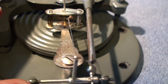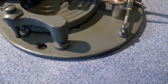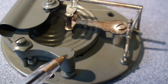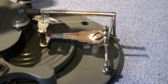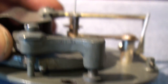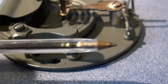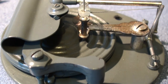Turn around. The screw you've adjusted in the back for setting the correct pressure is that screw there around the back. Basically that tilts the whole of the arbor system back and lifts that as well. There's a pivot point just down there — that's the screw on the back. So all of that mechanism tilts upwards, lifting that pin up and adjusting the pointer to the correct sea level pressure.